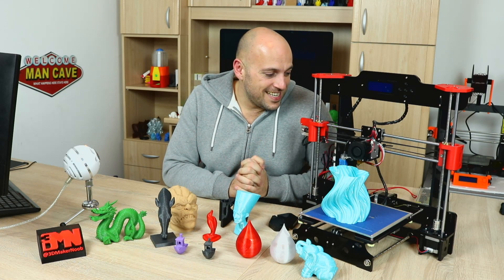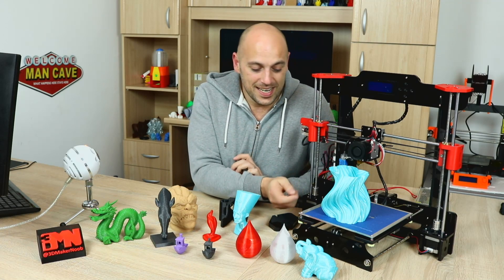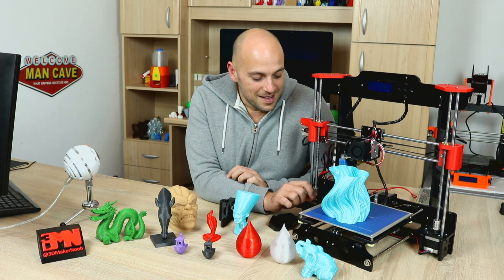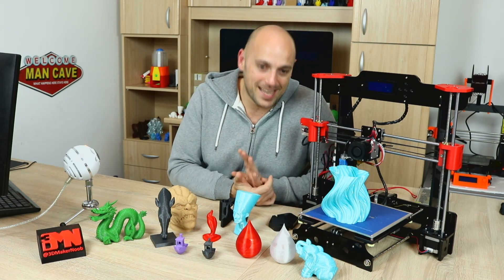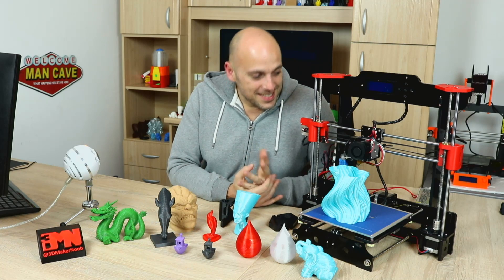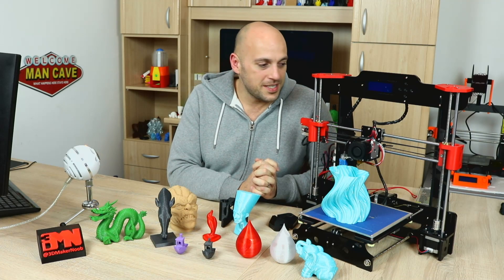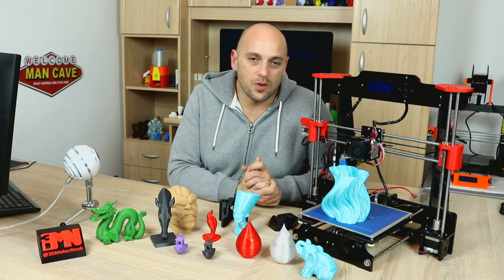The acrylic really makes it a bit flimsy — to such an extent that it actually warps the acrylic and adjusts the aluminum heat bed due to tension. So if you tighten it too much it starts warping the acrylic from the bottom rather than actually leveling the bed, which was kind of funny. The last thing is the wiring — everything is exposed. Cable management is difficult to get right, and at this price point it wasn't really worth it for me to go through all that trouble.